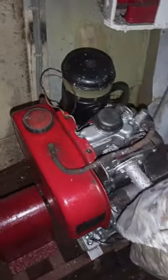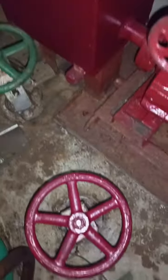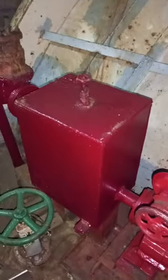For starting, what we will check: we will check the diesel oil level, we will check the low oil level engine alarm, we will check the battery voltage, and we will open the sea suction valve. We also have to lift up the decompression lever.